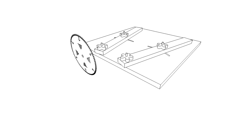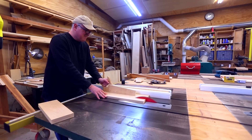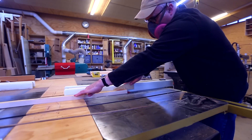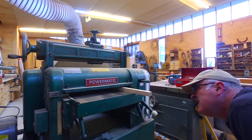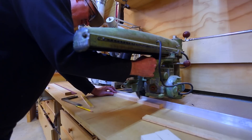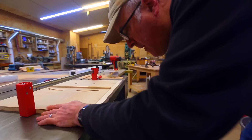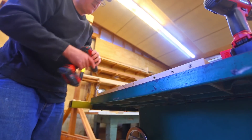I want to add more to the sled so it's more like a traditional sled with bed on both sides of the blade. I made the extra bit of bed out of the same MDF, then made a strip at the back edge to hold it on and a tall piece at the front. I planed the back strip to just a hair thinner than the MDF so it wouldn't catch on the table saw. Using screws, I can remove this extra bed section if needed, replace it as it wears out, or use it for angled blade cuts.